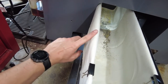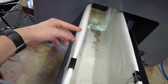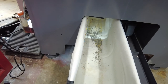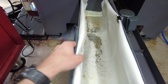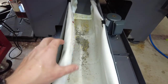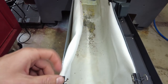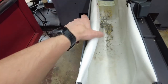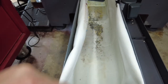There's one huge problem though — if you fold this filter felt over, it's wicking the coolant and dripping on the outside. So I have to clip it all on the inside somehow. I might just double it back over and rely on the clips to hold it up. It came out kind of gushing, so my solution for now is I'm going to double this over on the inside. In the future, I'll probably just trim it so the actual length is only up to the height. I'm going to need a lot more clips — or maybe put a piece of aluminum that clips on to keep it straight. I'll probably just get five clips on each side and clip this narrower next time.